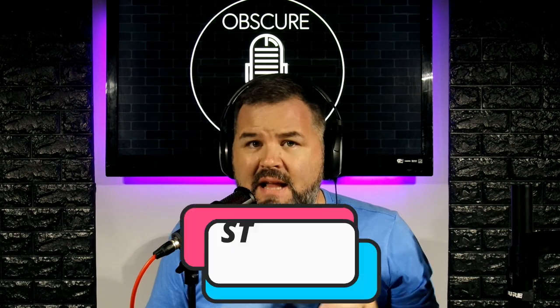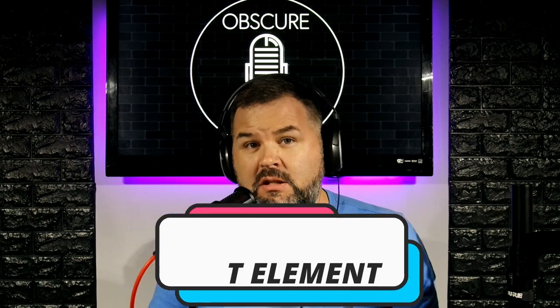It's got some red foam in the head basket, but it was a side-address condenser microphone. What we did with this microphone — as the title gives away — is all of the Aston Element treatment: we turned this into a phantom-powered dynamic microphone, end-address, phantom-powered.